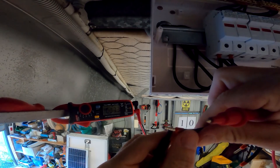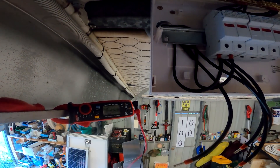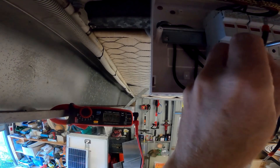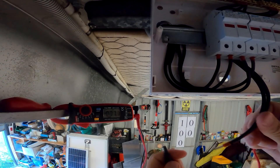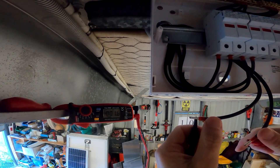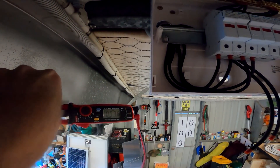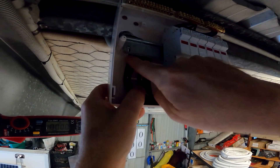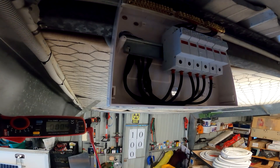Let's find the next two strings. Trying this one and this one — 92 volts, correct polarity, so this is the next minus. I'm not sure if this is string two or three but I'll connect them. Cable is too long, need to shorten it. For peace of mind, measure the last pair as well — 95 volts, wrong polarity, so this is the negative here. That one goes in as our positive. The cables are a bit thick in this area.